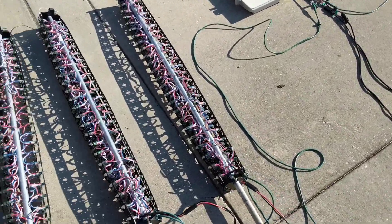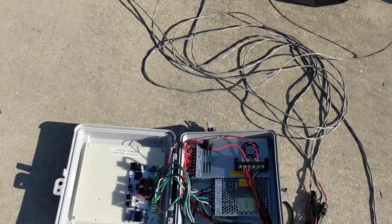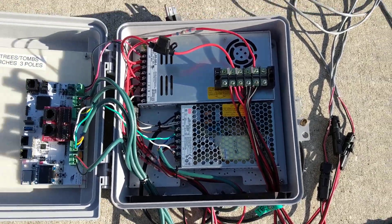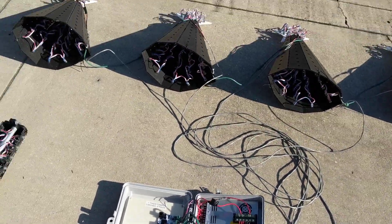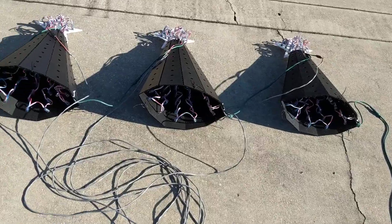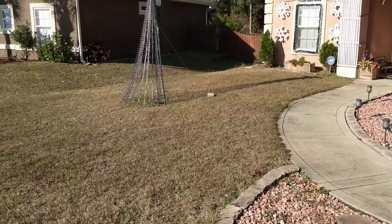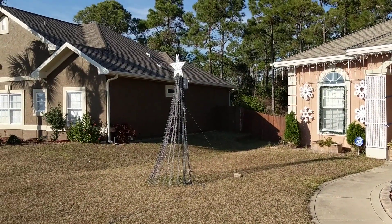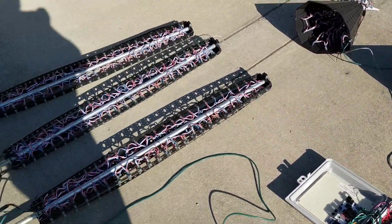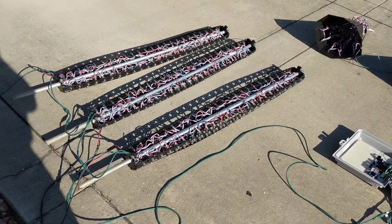All those props run off three ports on the F4 sitting in that box. Most everything is powered from this one 5-volt power supply. The 12-volt is just for the arches because I use 12-volt strips in those. The way it's wired, I can run everything at 100% brightness with no degradation in color or performance. Thanks to how awesome the Falcon controllers are, I also use an F4 differential receiver to run my pixel tree. I think this is a good example of what I was talking about when I said I wire power injection into my props. Happy New Year everyone!